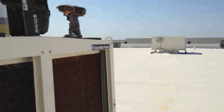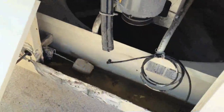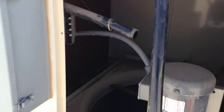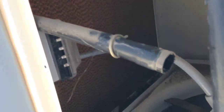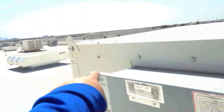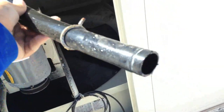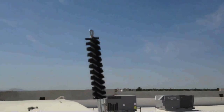Here's the other EVAP cooler I got to do — let me show you how I clean the lines up. I got the old water pump out and here's my new one. I got the water pump disconnected and pulled out. What I'm going to do — I have this big bottle brush that I'm going to shove through there. It goes to about right here at the end, right by that screw, and I'm going to clean that out real good. Same thing with the input tube and there's another line that goes toward these pads.